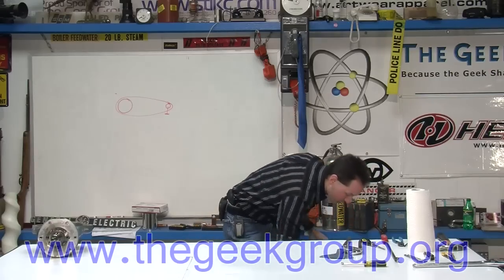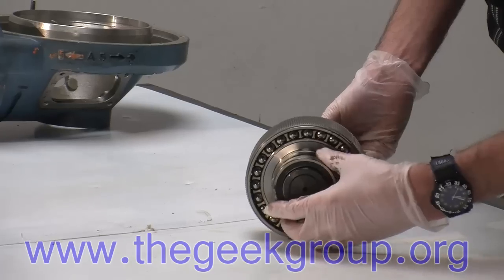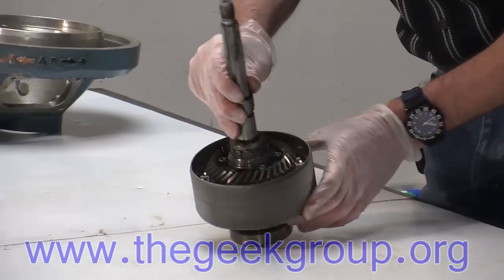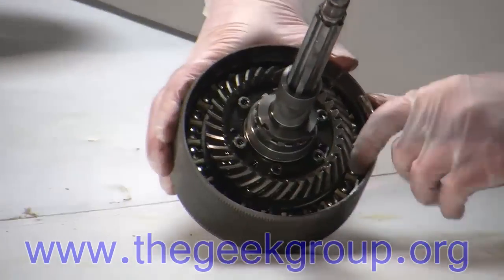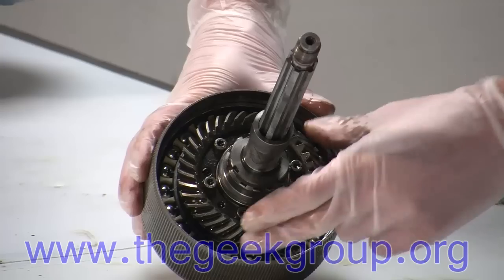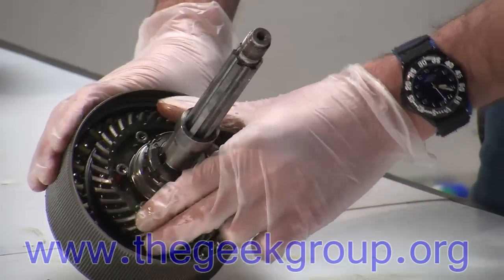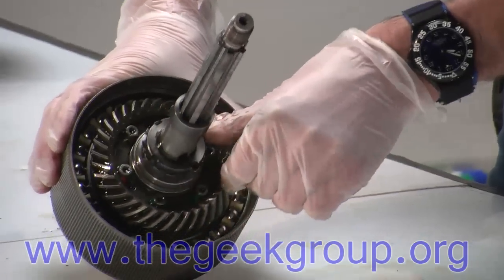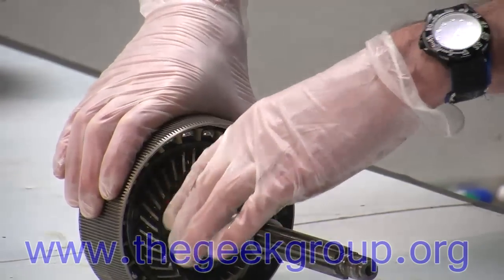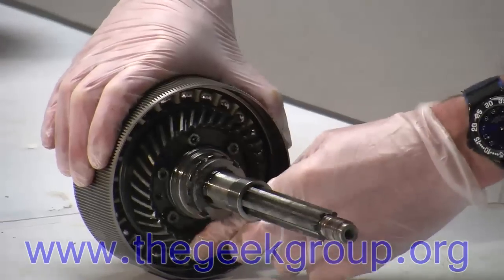Inside that, we've got this, which is just a beautiful bit of engineering. There's a basic bearing on the back, and a big roller bearing around it with a tooth spline. Inside, there's a really beautiful bearing — you can see the ball bearing race, which is the part that holds the actual balls. Then there's a beautiful helical bevel gear, and this is a friction drive. If you watch closely, I'm holding this still, and as I turn this gear, this gets fatter — like if I squeeze it, it comes back to a spot. It wants to be right there; that's the skinny part. See how that moves?